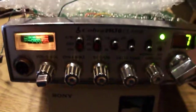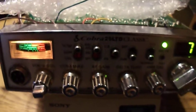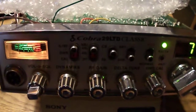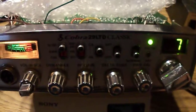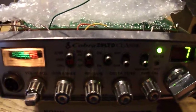What you're listening to is CW down at the bottom of the 20 meter band. This radio has a frequency coverage of right around 14.400 down to, I believe, 13.95 megahertz. The radio is not transmitting yet — it's going to have double sideband transmit once it's done, but it will transmit a carrier.